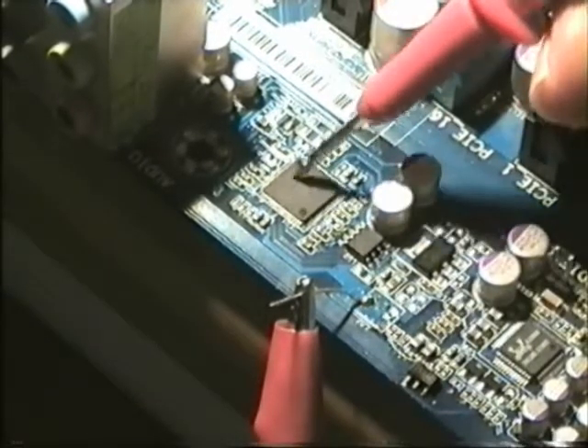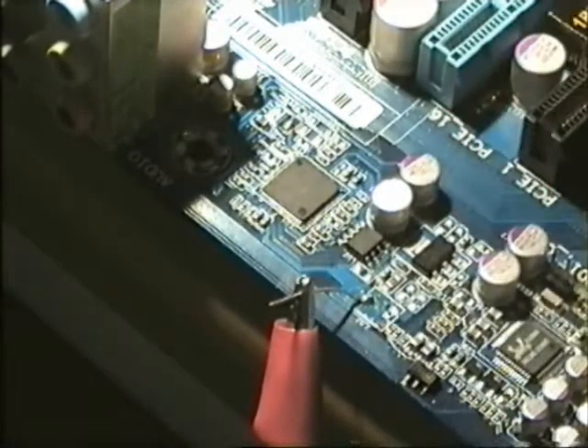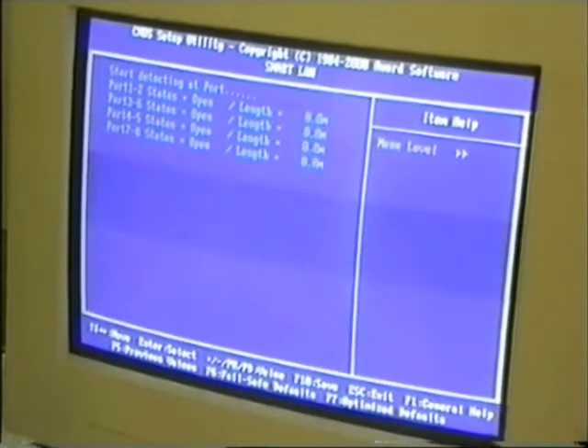What I've tried is soldered this pin onto where the tab goes. I'm going to give it 1.8 volts externally just to make it so I can start the board up — you know, just to prove a point, to ensure it still works. So I'm going to stuff 1.8 volts up here and show you the screen. What we will see in integrated peripherals is the onboard HW LAN setting has reappeared. Now that 1.8 volts is being fed into the board, the Smart LAN is also working — I haven't got a network cable plugged in, let me just pop one in. Right, it is doing something there which it wasn't before.